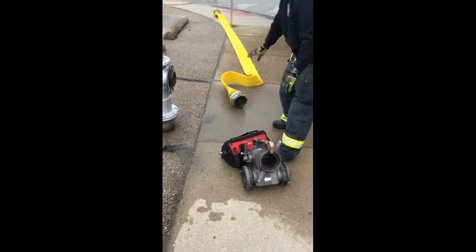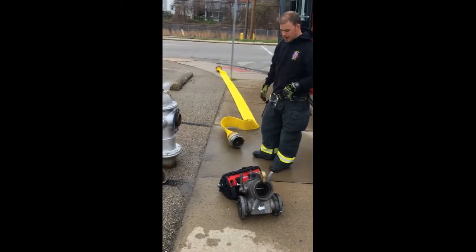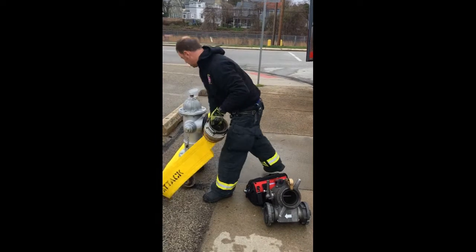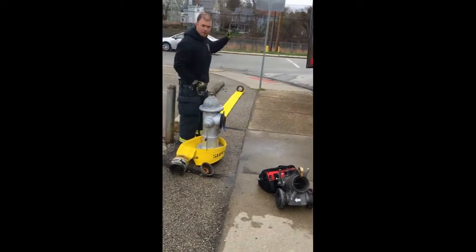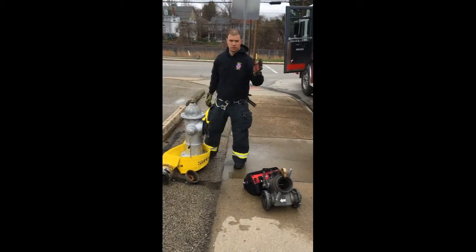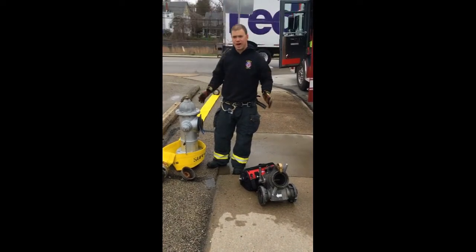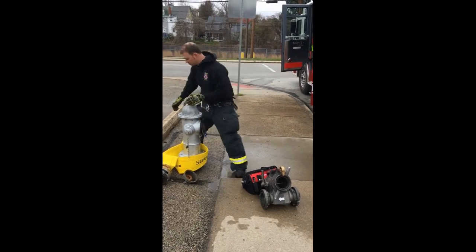This piece of 5-inch is simulating the hose line coming off the back of the truck. You're going to grab this equipment and wrap the hydrant. Then you can give the driver the okay to move. Once they take off and there's a length of 5-inch in the street, you can start your operation. There's no need to rush — they've got plenty of water on the truck, so take your time and do this operation thoroughly.